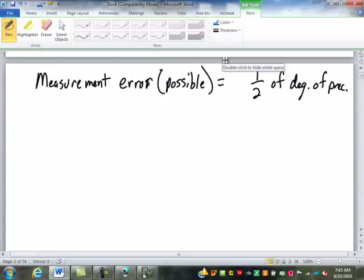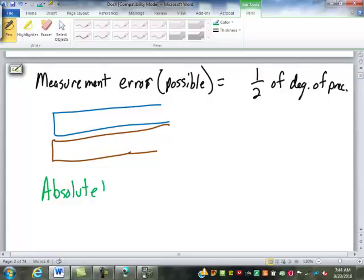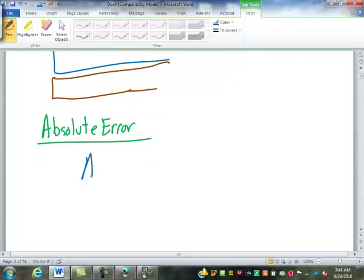But then there's also human error. If you've got your ruler here and you're measuring an object with it — let's say the blue thing is the object you're measuring — and you don't get the end of the ruler perfectly lined up with the end of the object, that could be human error, throwing that off. So that's not just the error in the measuring device. All of this comes together to create our overall error. So we have something called an absolute error, and an absolute error is just your total error — it is the difference between the actual value and what the measurement is.